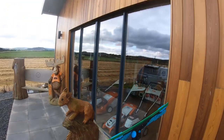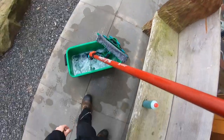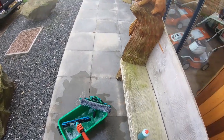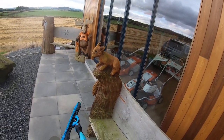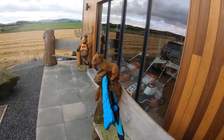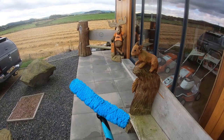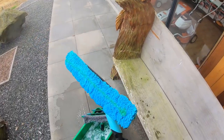So I'm going to go around all the bits of glass I can't reach with the 14 inch accelerator squeegee. Dunk that in the clean water — there's nothing in it, any frothy water is just excess soap from the applicators. Now because these are quite large windows, you need your applicators fairly saturated, especially if it's quite warm — as wet as possible. But here's the crucial bit that will make this tool work very well: use some dish soap directly onto the applicator. This is just Fairy liquid, the original one — put a line on there.